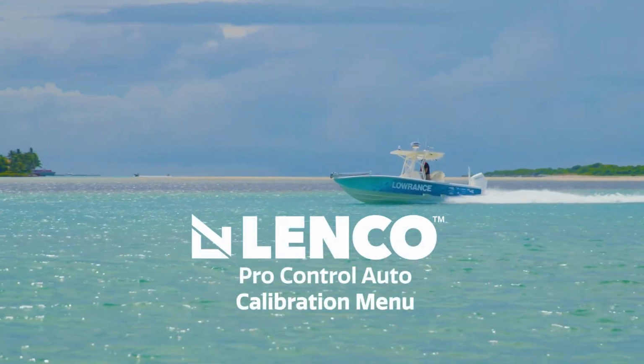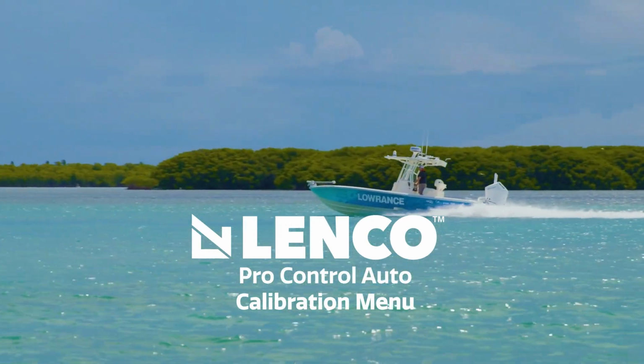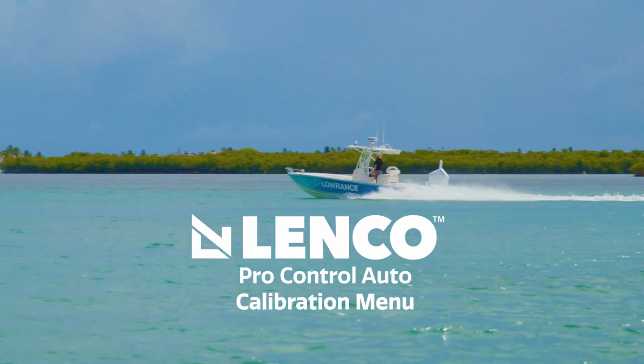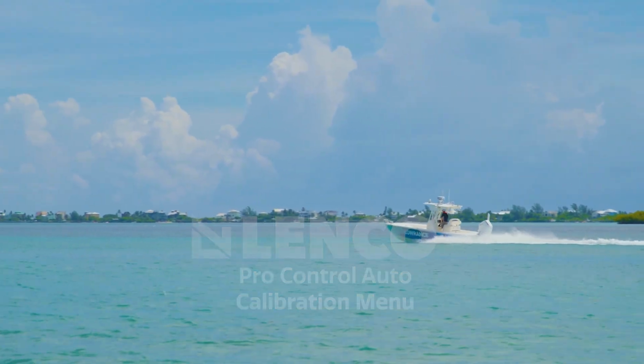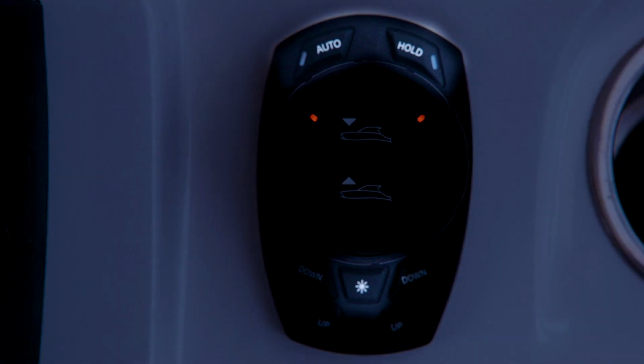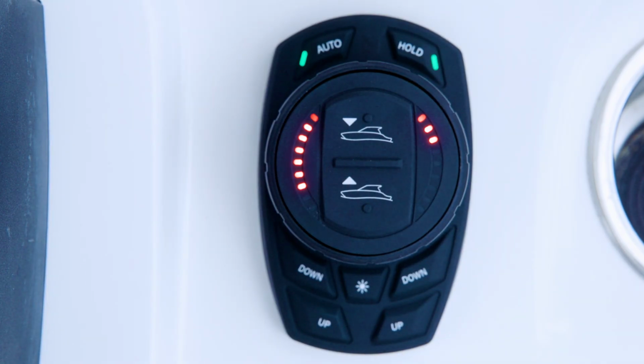ProControl Auto has a number of different settings to customize the ride of the vessel and the responsiveness or authority of the system. These settings are accessed in the calibration menu. To enter the calibration menu, press the auto, hold, and dim buttons at the same time and hold them for 3 seconds. On the first power-up after installation, the system will automatically enter this menu upon exiting the configuration menu. The auto and hold green LEDs will begin to slow flash in sync to indicate the keypad is in calibration mode.